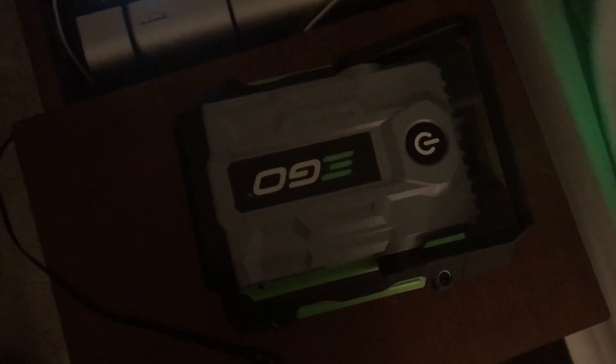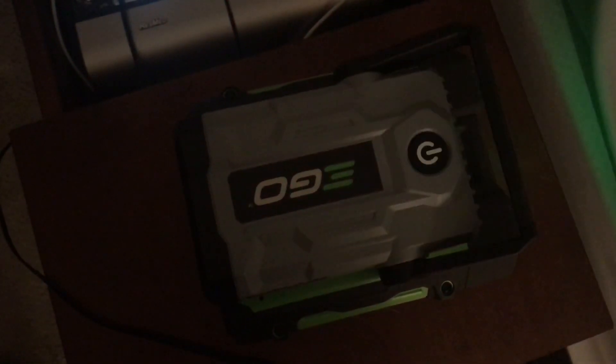If you're buying this for a CPAP, it just doesn't quite have enough power for some CPAPs. Your CPAP may be different — you'll want to definitely do the math: watts equals volts times amps, and that'll tell you how much power you need. In the case of mine, I think it'll be a nice little device, but it's not going to suit my needs for using it with a CPAP. I need another solution if I want to go camping.